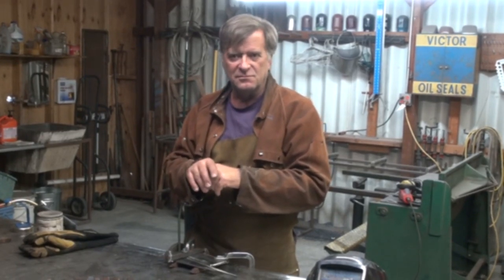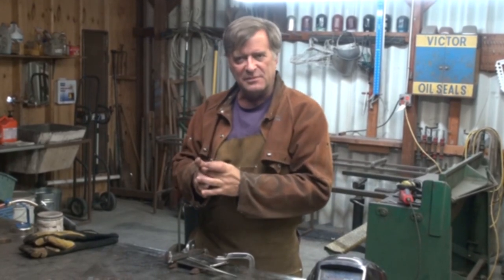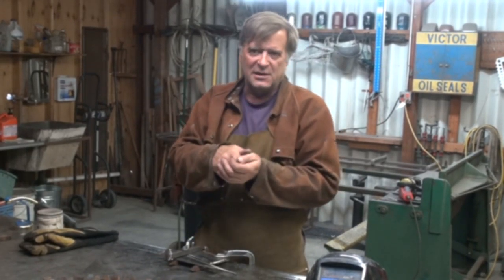That's just part of being a good welder — being able to get that fit correctly. Is there ever any issue with air coming up between the gap and affecting the weld? That's porosity right there. When you're welding and you've got that puddle of molten metal, you're superheating the air above and below it, all around it. If you've got a gap and that puddle of molten metal is right there, it's going to start to pull air up. As that hot air rises, you're literally pulling air from under the weld up into the weld as you're trying to weld along — just giving yourself more problems by not having a good, tight, close joint.